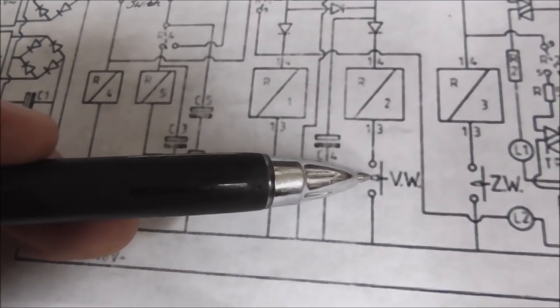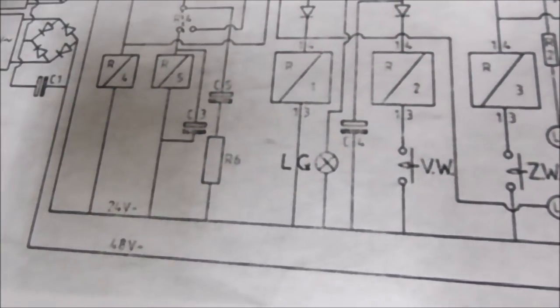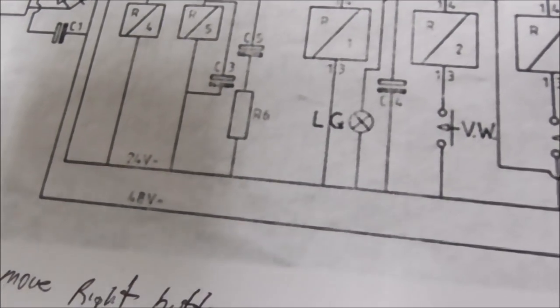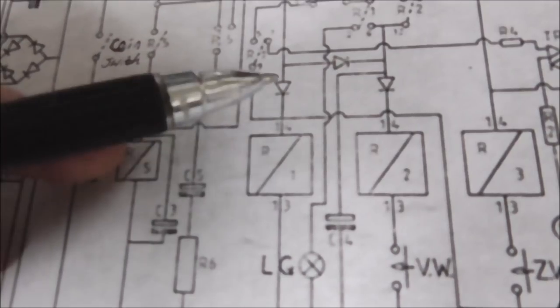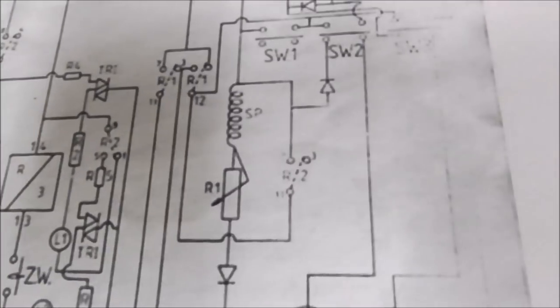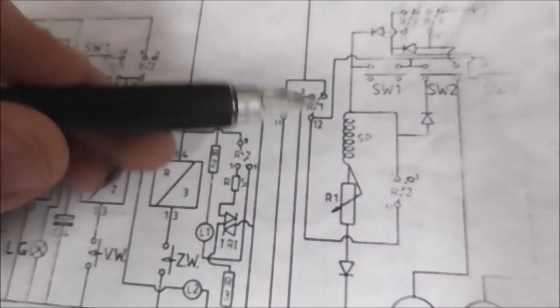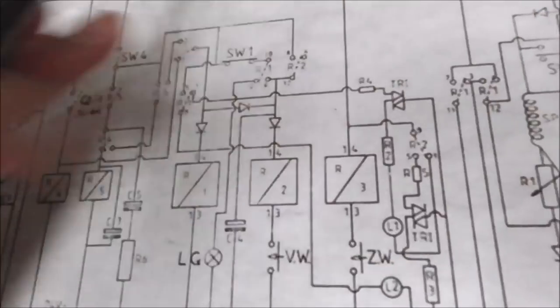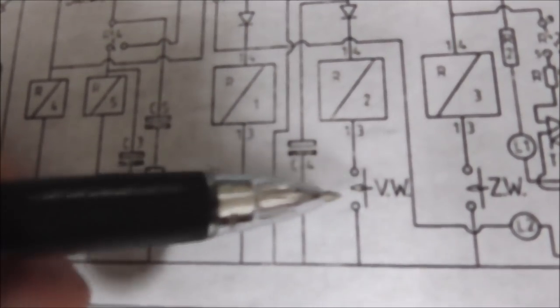So then you push this button in. Well, as soon as you push this button in, relay 2 starts the motor moving over on the side. So relay 1 isn't moving a thing. What it's doing is turning both of these, which is basically reversing the power over here. We'll talk about that in a minute, okay? But now we have the potential for relay 2 to work. So when you press this button,